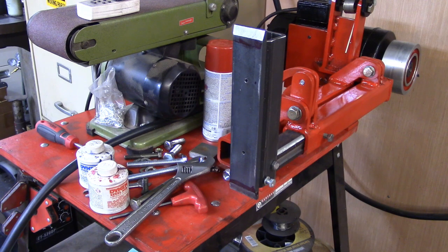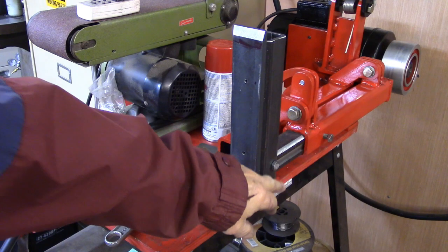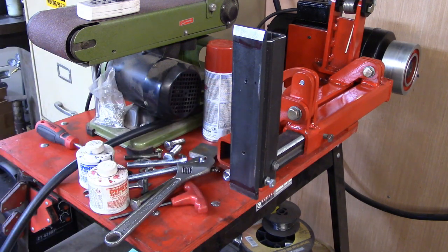So that's just sort of stuck on there. This is facing the wrong way. I turned it around, so I didn't finish tightening up the bolts to hold it on there. I've got 1/4 20 by 1/2 inch screws in there, and after putting it in there I realized this piece right here is a 1/2 inch, so I've only got it halfway through there. I need 1/4 20 by 3/4, but I go from 1/2 to 1 inch over there in the box. So I'll definitely have some to grind off. But anyway, that's how it's going to fit. Move on to the next step.